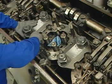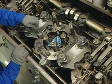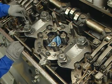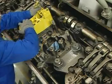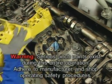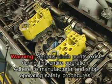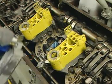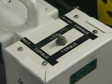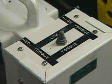Manually seat the nuts while moving the crab bolts back and forth. Before final torque is applied to the crab nuts, check that the crabs are positioned so a socket can be applied to the head-to-liner stud nuts. With the use of the hydraulic torque machine or TAME wrench, and after manually seating the crab nuts, apply an initial torque of 400 foot-pounds or 542 newton meters. Position the hydraulic output device over the drive socket on the crab nut being torqued. Set the hydraulic torquing machine to low torque and engage until the specified torque is achieved.